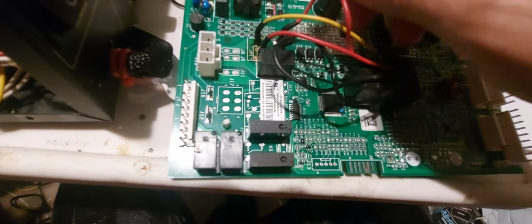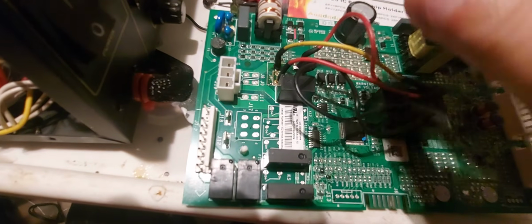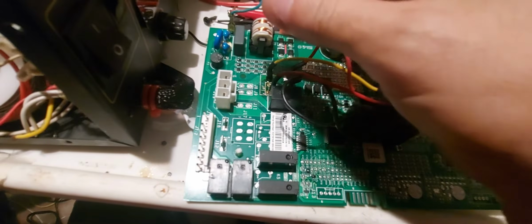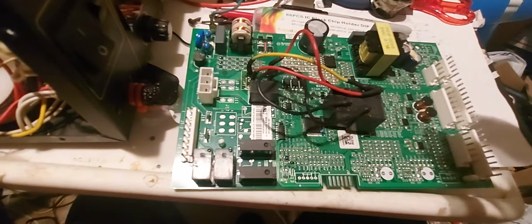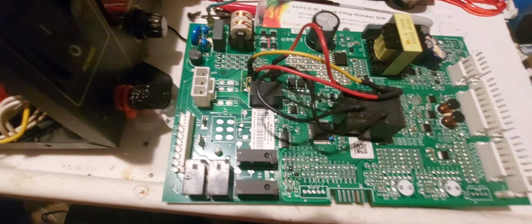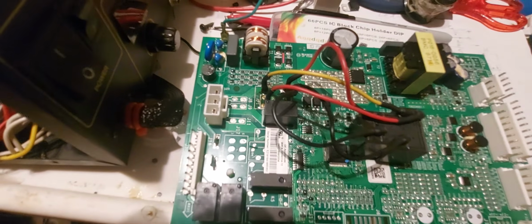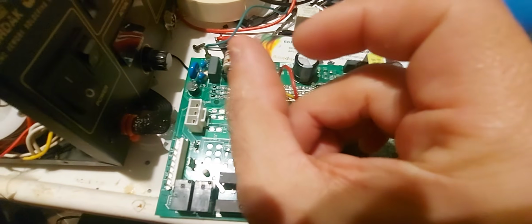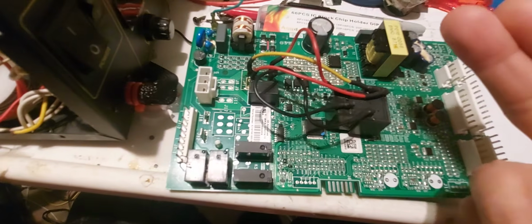These wires, when you twist them, I don't think they would fit into the hole of the board. So you can take a very tiny drill bit, and go with your fingers around like this. You can make the hole slightly bigger, and I mean slightly. It's got to be slight. Or what I did was, I had a bunch of fairly big diodes, maybe about that big, at least. And I cut the legs off.